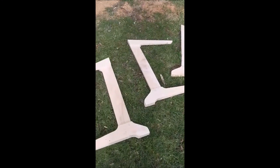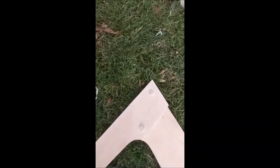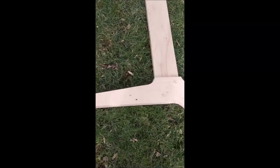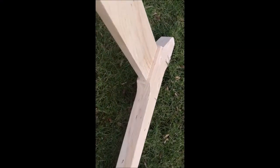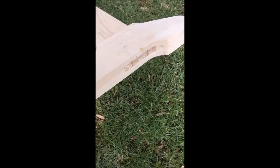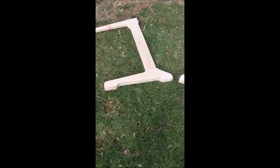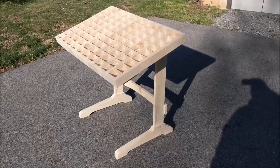Taking a closer look, I took the time to lay them out symmetrically on the joint — each one down here mirrored the same layout as up there. This joint here is a mortise and tenon joint; it's got clearance all the way around the perimeter, and on the bottom you can see the wedged tenon. That should be a nice strong mortise and tenon peg joint on the bottom, and then a half lap joint on the top. Let's get the glue set up overnight and we'll sand it all down in the morning.